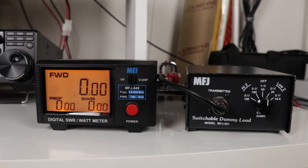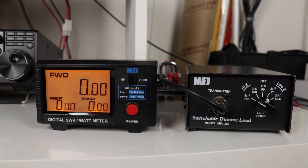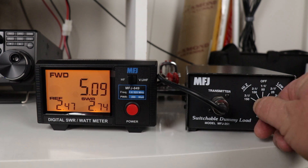For this portion, I'm going to be using my Yaesu FT-991 Alpha. One of the things it says in the instruction manual is to make sure when using this in any position other than off, run it at low power to eliminate the possibility of damaging your transceiver — so we're going to be using 5 watts. In the off position it shows a perfect 1.0 SWR, and you can see the 3 to 1 and 2 to 1 readings on both the high and low Z sides.